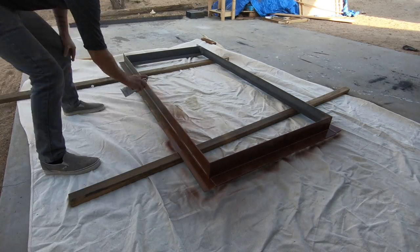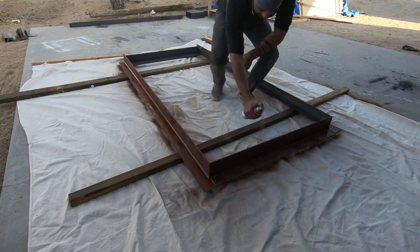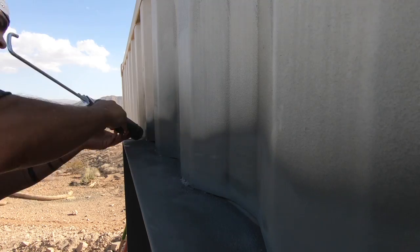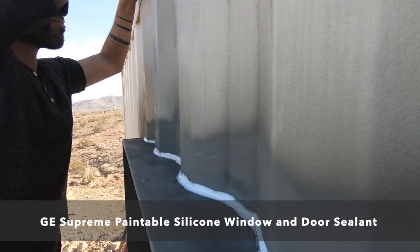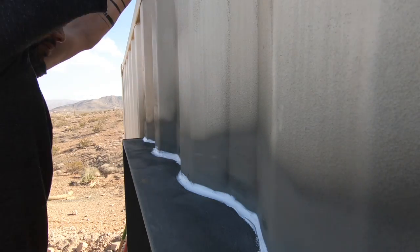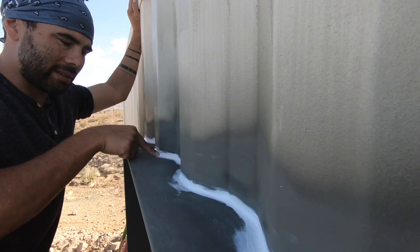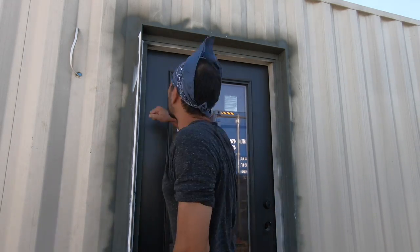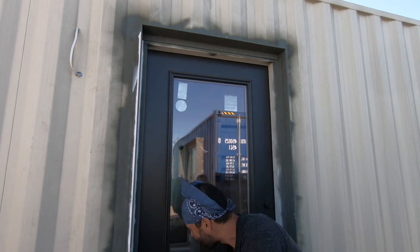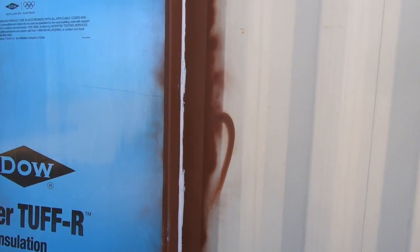The rusty metal primer was way easier, so for the remaining doors I pre-primed them before installing them. I did have to grind away a bit of primer in order to weld them into place though. Once the primer was dry I sealed the cracks with GE paintable silicone. I've had really good experiences with GE sealants and this is also the product my painter recommended. The single bead of silicone isn't the only thing keeping water out — if you go back to episode 3 you'll see how I used angle steel to create an overlap that will protect me even if this silicone should fail. I probably over-applied the caulk but knew it would be fine once painted.